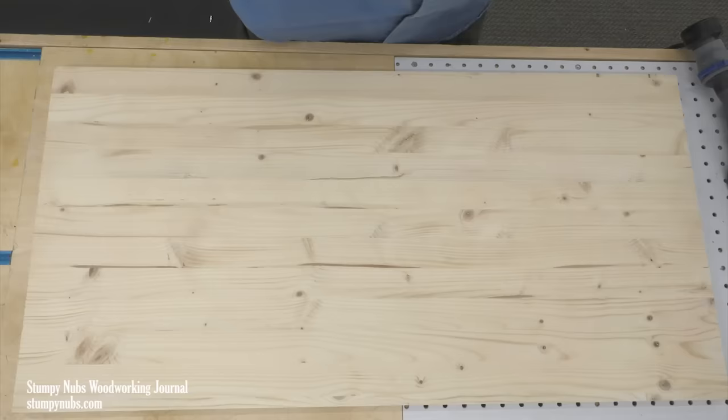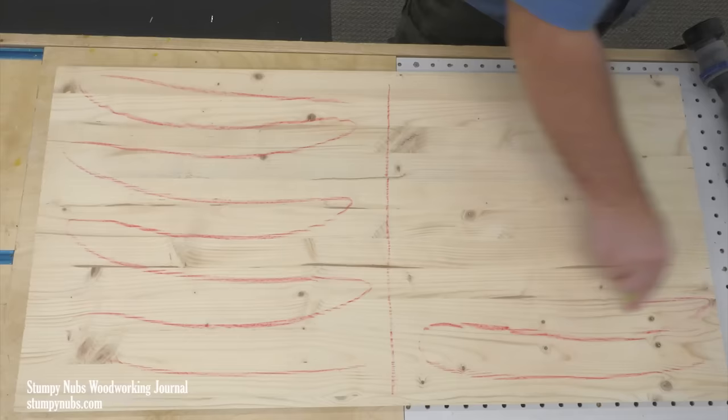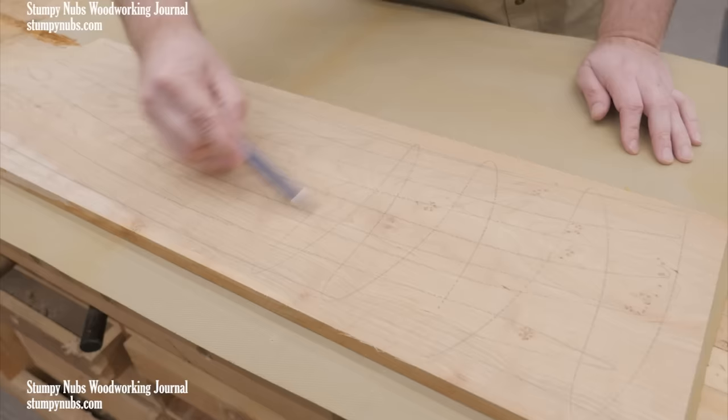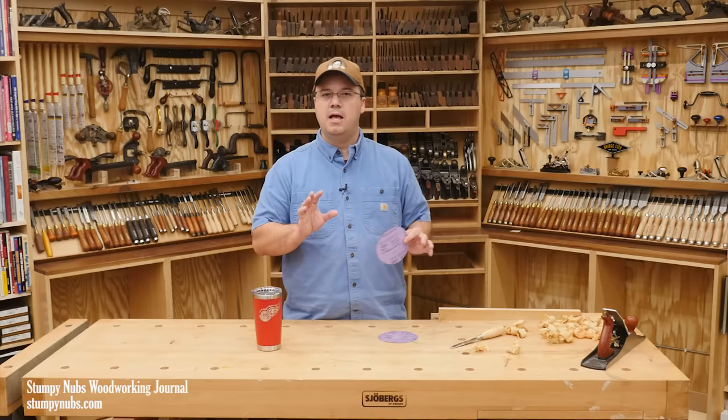I've got a big wood panel that I've already pre-sanded to 180 grit so the whole surface is consistent. I'm dividing it in half and scribbling some lumber crayon on the surface — this is just wax, it doesn't penetrate into the wood so it should sand off easily. By the way, this is a great way to keep track of your sanding process on any project. I often use a pencil to mark the surface, and when the graphite is gone I know it's time to switch grits. It's also going to show the progress in our test.